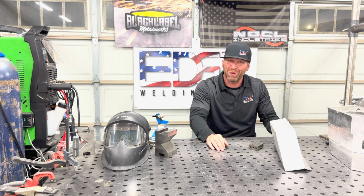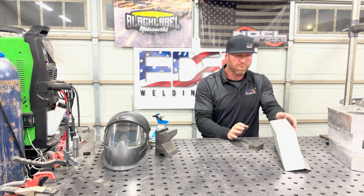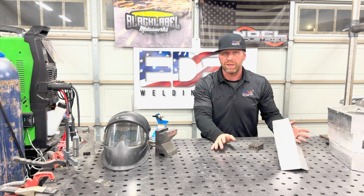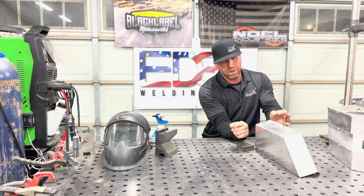We're doing it to pay the bills. So the way I address this, for a lot of reasons, I'll weld my uprights first. I call these uprights. So I got 4 uprights. I'll weld those first and I'll disperse the heat. Sitting it like that, I would be completely offset. It's not gonna be a great weld.